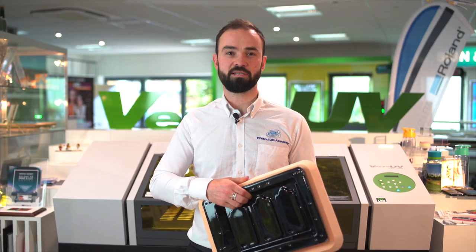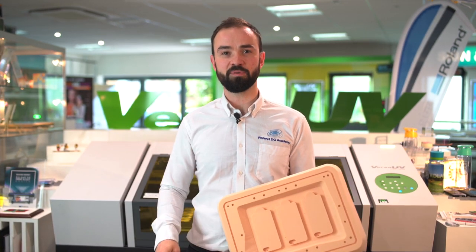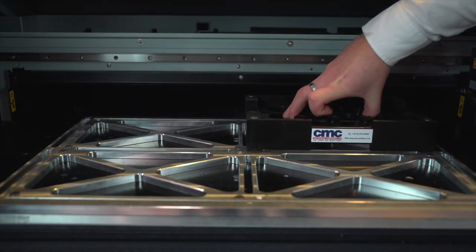As an extension to using a cutting device, you could create a mould and then vacuum form multiples of the outlines of your items — this would be perfect in a production environment. When printing multiples of different items at the same time and wanting to change the layout or setup, you may want to create an interchangeable jig system. All of the items need to be printed at the same height or as close to as possible.